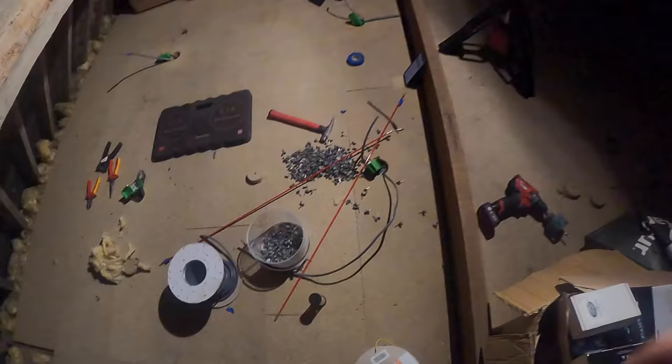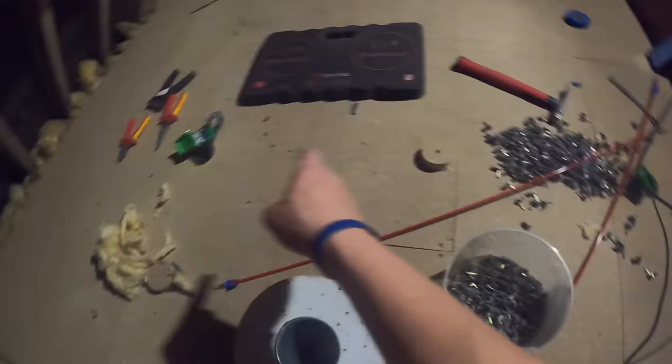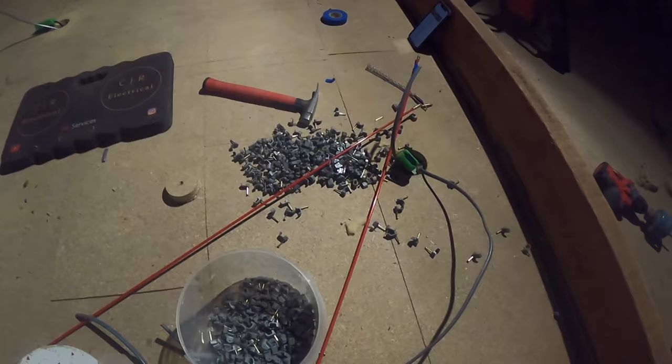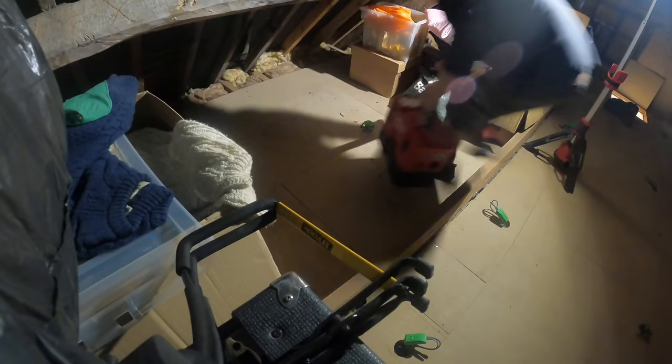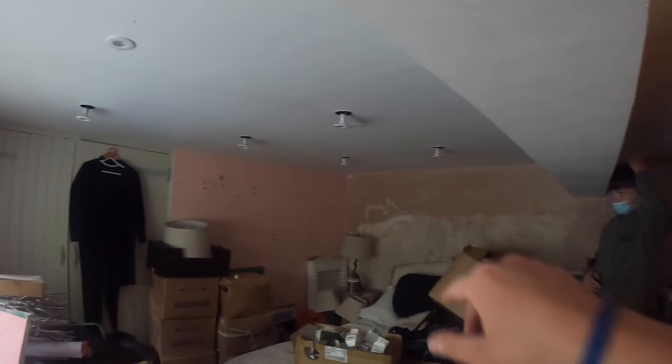Right, finally, we're nearly there on this one. I don't know if you can see it very well, we've clipped our cables along. It jumps in, goes through, comes back, comes along, jumps in, and then we've got end of line over there. I've done the standard kick the clips over, so that'll be a nice little job for James. Oh, my client's got the task now, putting all this back. We're pretty much there now. We've got all the lights, James is lamped up. Got a little bit of testing to do.